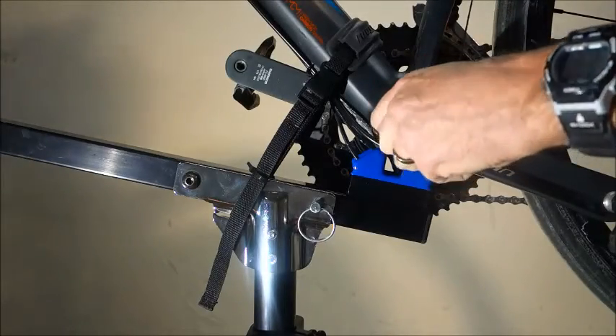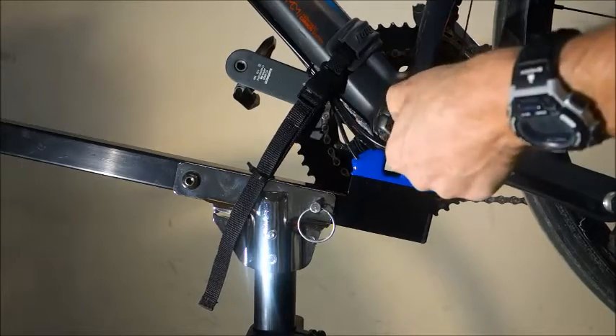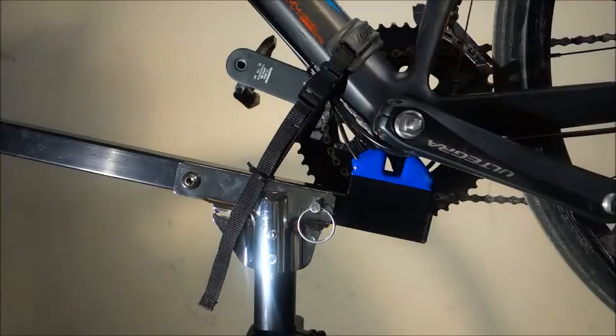The adapter should be installed manually if possible. The wrench flats are only provided to overcome grit or minor nicks in the threads if present. No additional torque should be applied once the adapter is seated.